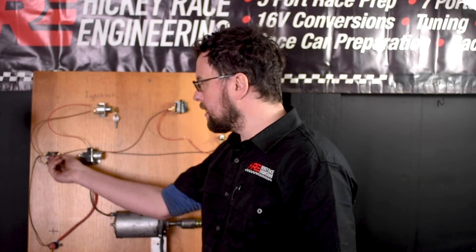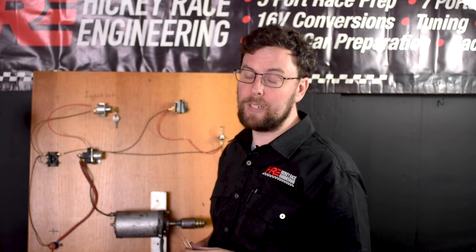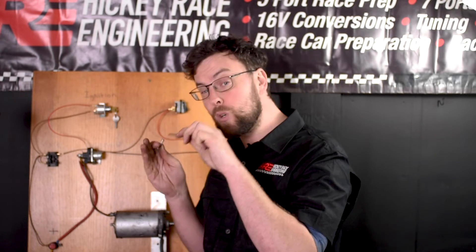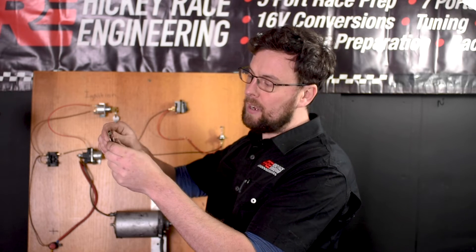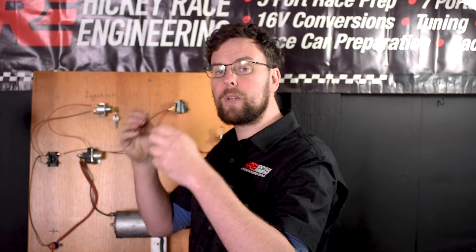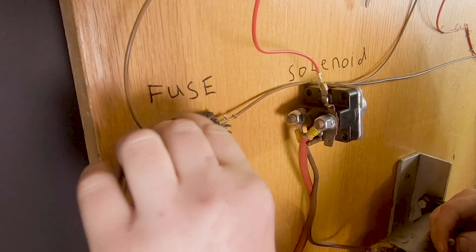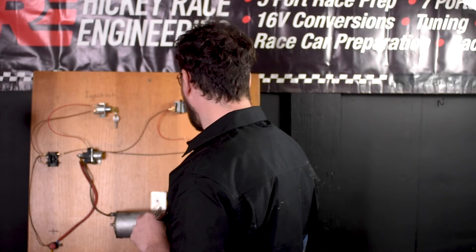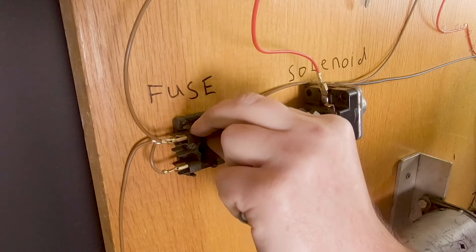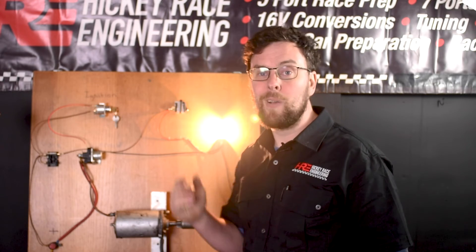I'm going to show you how we fix it. We know the fuse is our bad connection. I've just popped the fuse out and I'm going to show you this little diamond file — these are wonderful and not very expensive; a wonderful investment if you're running a classic car. It's shaped like a spade so you can put it inside the connection of the back of a switch or plug. You can also simply give it a twist on the end of this badly corroded fuse and clean it right up. The diamond is just lightly abrasive — strong enough to clean it up. I can show you how we use it here on the fuse board by giving these fuse connections a little bit of a sand and cleaning up those connections. When we put this fuse back in, the bulb lights — we diagnosed our connection and found our problem.